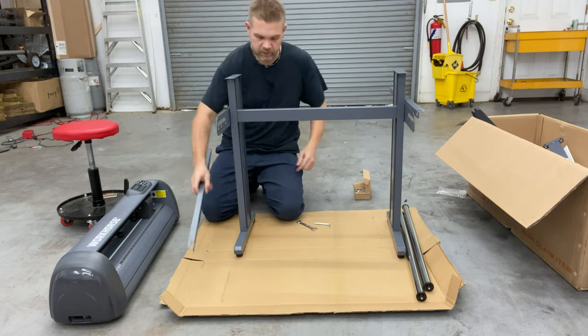The next thing we want to do is make sure we ground this machine down. I've seen people not put these on there. If you're using this for window tint — which I'm assuming you are — a lot of window tint has static built up in it. This is just a precautionary measure so that if you build up static with your tint or through your body and touch the machine, it doesn't short it out. The best place for this wire, given its length, is the top bolt facing this way. We're going to loosen the nut on the inside of the machine, slide the fork down between the frame and the nut, and tighten that down — that'll ground that machine down. There we go. We've got the ground attached, ready to go.